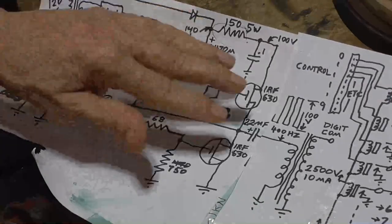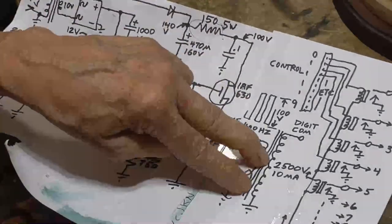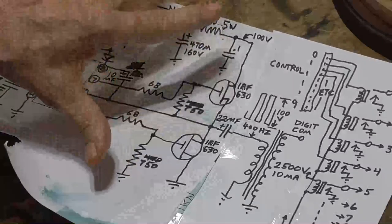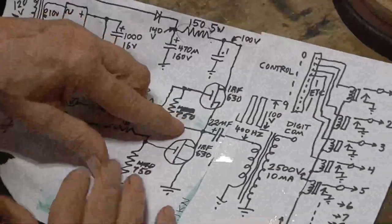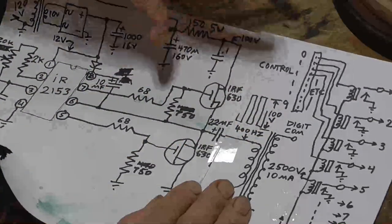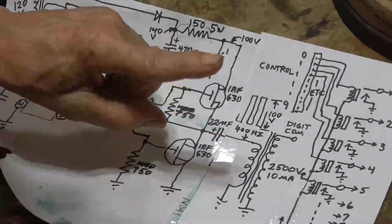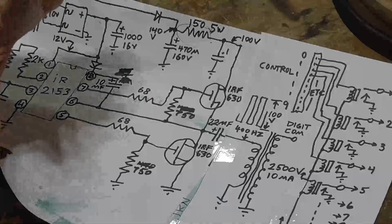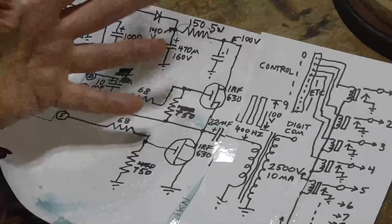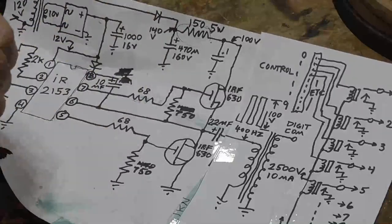Okay, now, when you couple the output of this onto a coil, you cannot just straight couple it. This is a unipolar drive. In other words, the output goes from 0 volts up to whatever your supply voltage is. It's not bipolar. To drive a transformer, you must have bipolar drive. You cannot drive it unipolar like this. You'll saturate the transformer in one direction, and you'll only get half the output that you would get if you drive it in both directions.